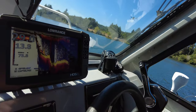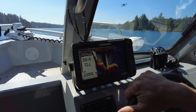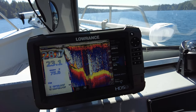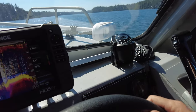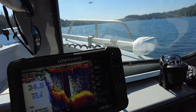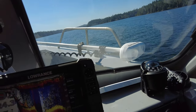Adding throttle, we're going to bring it up to about 3,500 RPMs where it should take a plane. It's going to be nice and windy because I've got the front open — we have a nice day finally here on the coast. There's 24 miles an hour, almost 23.8. We'll come up to only 3,800 RPMs. We are trimmed all the way down, so our bow's sitting a little high. We have trim tabs as well, but we're not going to introduce those into this scenario yet.